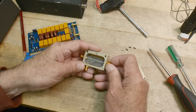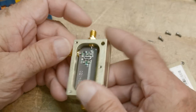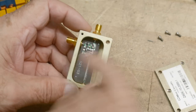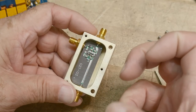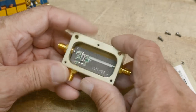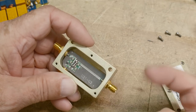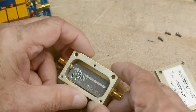One thing to mention about this board: notice it's kind of a gray color, and if you touch it you'll notice it's slippery — it feels almost soft and slippery, like you're rubbing your finger on a Teflon pan, because it IS Teflon. The Teflon dielectric is much more repeatable and better controlled. It's better for high frequencies — this goes up to two gigahertz. You'll also see Alumina boards, which are ceramic and probably the most expensive, then Teflon as a step down, and then FR4 as the cheap stuff. You can get Rogers and all kinds of different materials, but Teflon boards are really nice.